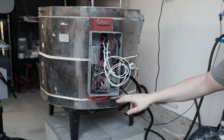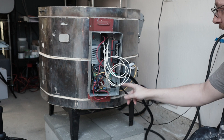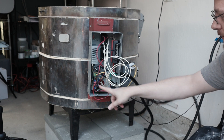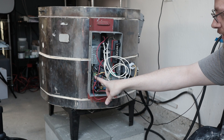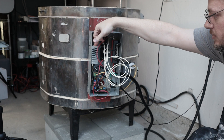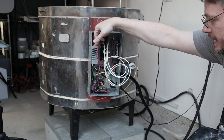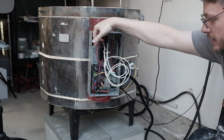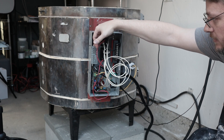Inside the box from the bottom, this is the Raspberry Pi — I've mounted it and I have a USB connector coming out the side. From the Raspberry Pi we get up to the board I created before, which has the MOSFET drivers and the sensor board for the thermocouple. It's connected to a power supply that gives me 5 volts and 12 volts. The 5 volts drive the Raspberry Pi, which steps it down to the 3-volt logic it uses, and the 12 volts drives the relays.